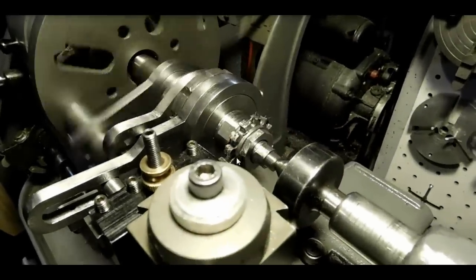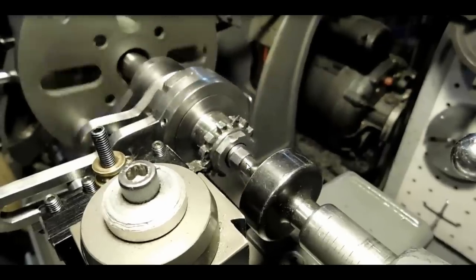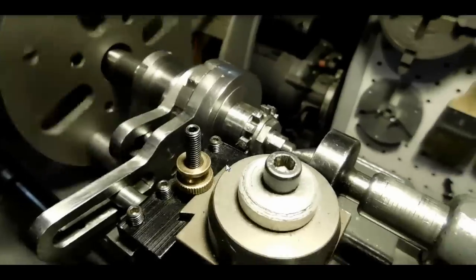And there's our cutting right there. If you can see that arrow, I'm pointing to the cutting of the back side there. There's your 30 thou eccentric that allows the in cut here. So the in cut on that is 30 thou.